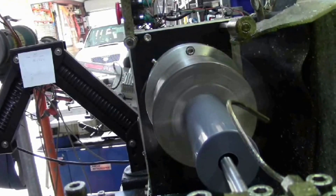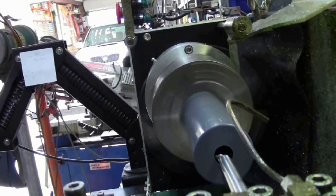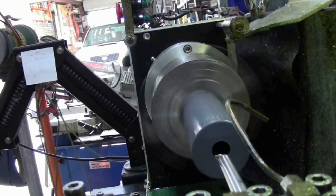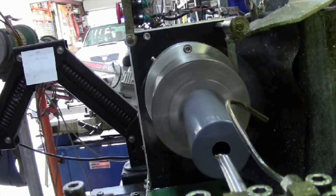I've actually opened that bore up to 16 millimetres for some of its length to help with the swarf. No swarf came out, which means I've got to do a manual clear from the other end through the spindle. I first try compressed air; if that doesn't work I get an aluminium rod and shove it up the end and push the swarf out that way.